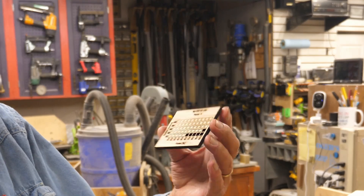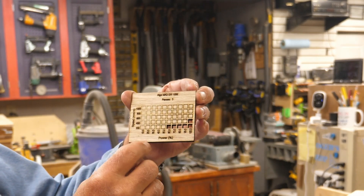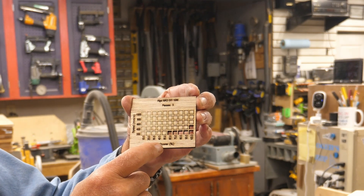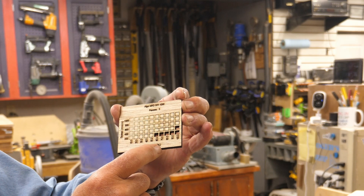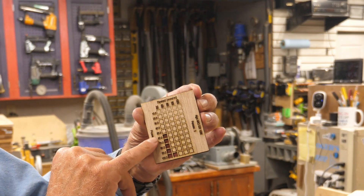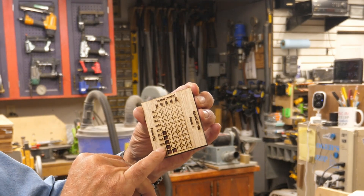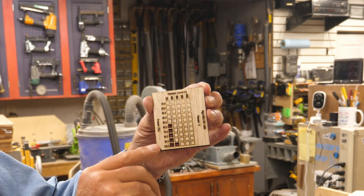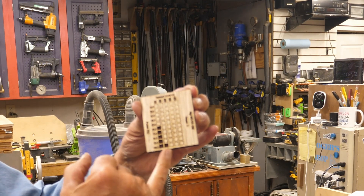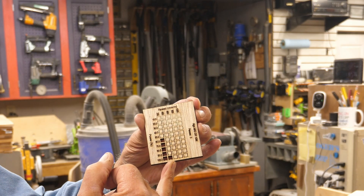Getting back to this cutting test - you can make this bigger, I shrunk this way down and I'll show you how to make a bigger pattern. This is done with three passes on quarter inch plywood. Power is down here, so we're at 60 percent power at 200 millimeters per minute. I found my sweet spot to be 350 millimeters per minute at 100 percent power, although this shows 400 at 100 percent power will give you a good cut.